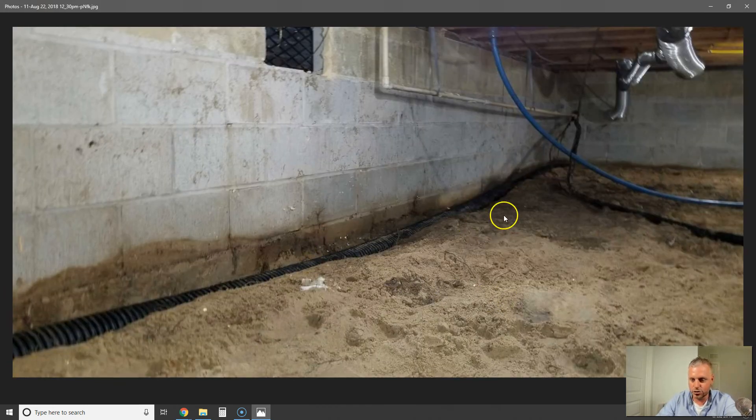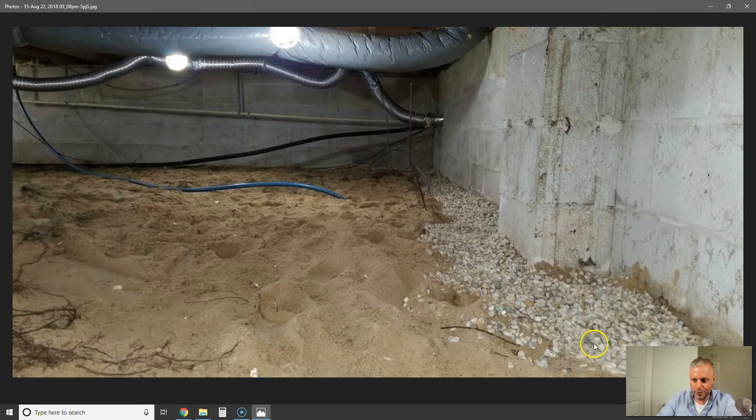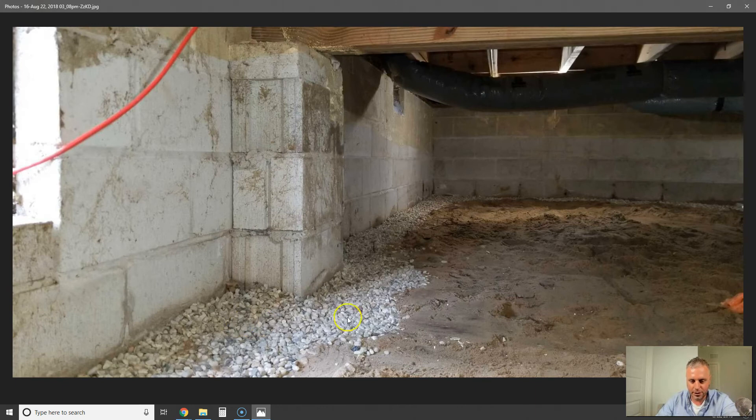You can see this drain pipe goes everywhere — we dig the trench deep down everywhere, and then it's all covered with stone aggregate all the way around. This way, the water that comes up through there, or even comes through from above, all goes into that drain tile. It's filtered of dirt and gets into the drain tile, which allows water to easily flow into the sump pump. We don't cover the drain pipe with soil — all this will be graded and flat. You never want to put soil back on top of the drainage, as that would cause it to fail early.